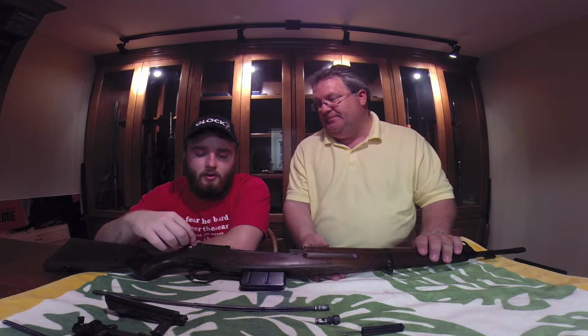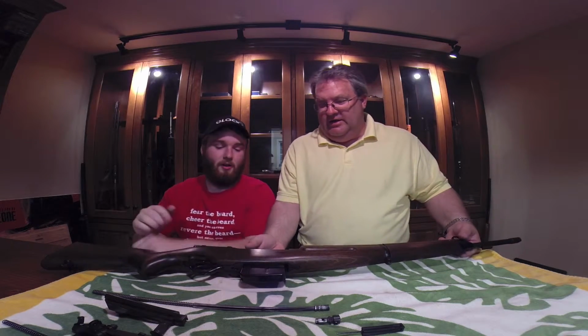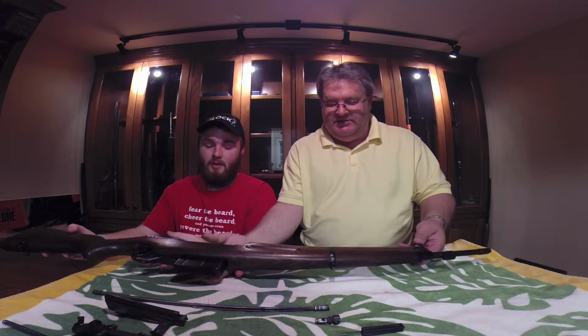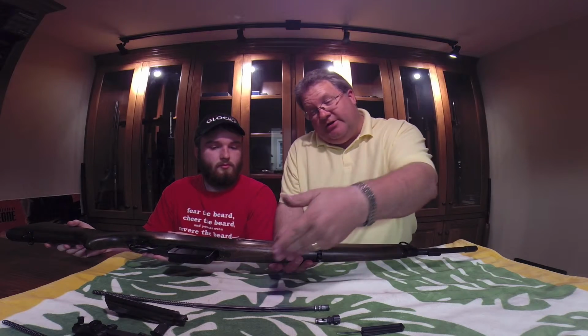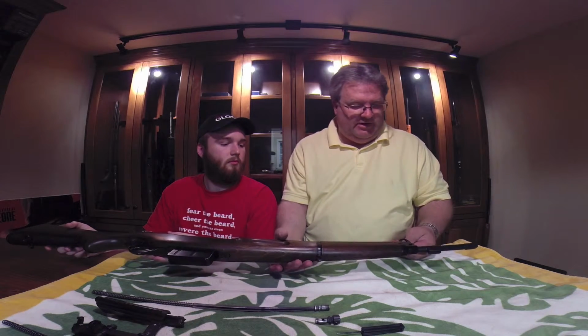It shoots fine. But like we've set up, we've got us a rod we take with us now. So if one does get stuck, you can pop it out of there pretty quick. And it's irritating. Your lacquer gets heated up in there and creates a gummy type of substance. And then your casing gets stuck. It turns into glue. Your ejector can't get the casing out. Yeah. And it'll end up ripping off the back end of your shell. This thing has a heck of an extractor on it because it ripped off cases trying to get a couple out, which could also break your extractor, and on these guns I'm sure you can find some parts for them, but like anything else that's 75 years old, your parts are going to get hard to find.